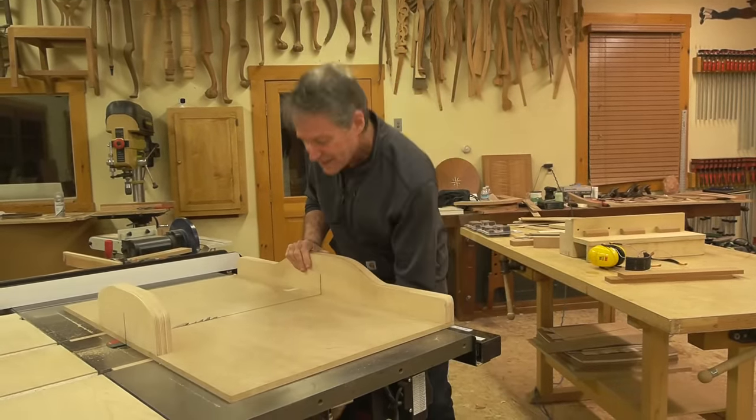And then there's this back rail fence, which I've laminated Baltic birch up to make this. I've actually got 3 layers of 1/2 inch Baltic birch to make this fence. So it's really true and strong and staying straight. And then there's just a back fence here that holds it together, because you're basically sawing this in half. So the fence needs to be high enough that you don't saw through it. And the guide rails are running in the slots nice and true. So once again, you have this sense of zero play, and we're getting a nice cross cut.